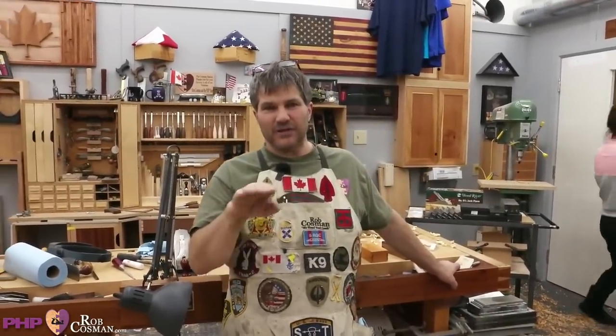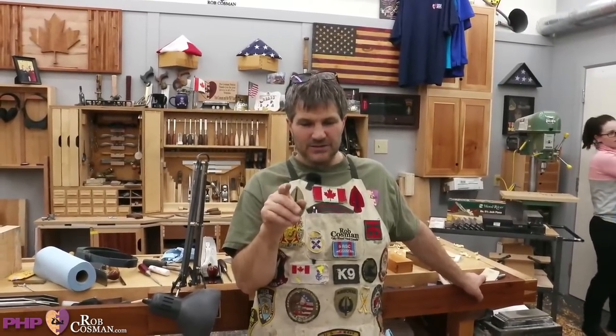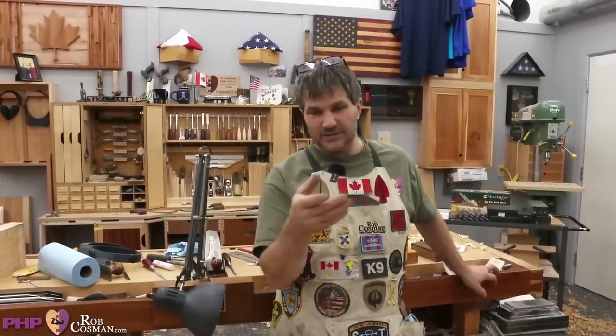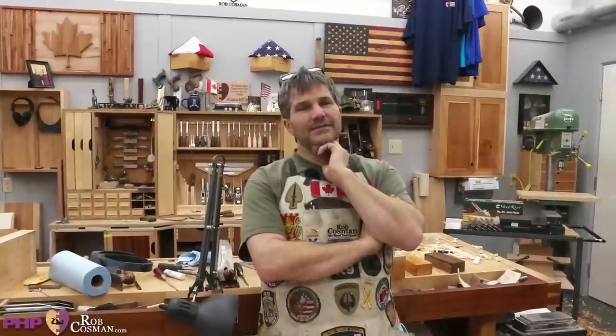So when you get to your 8,000, the back has to be flat. The stone has to be flat. And what often happens, as Jake's mentioned, is you've lost the flatness at some point in the lower grits, and then you get to that 8,000, and you're only touching in a part area and not the entire surface area. You have to keep them flat. Well, I was alluding that I'm not spending enough time on one grit, and advancing too quickly and then trying to polish 1,000 grit scratches on your 8,000 grit stone. Yeah, but you would still end up having little shiny spots, and that's when you actually would see.